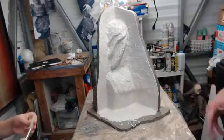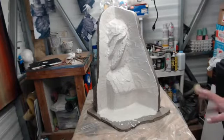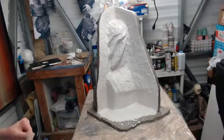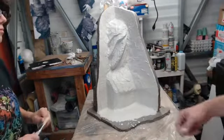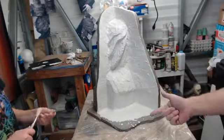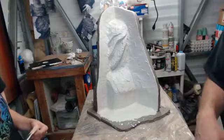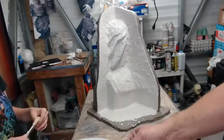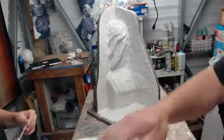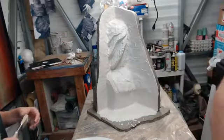Now, the good thing is once you get through the first couple of print coats, you're pretty good. You don't want to get too lazy. But if you find you have a little bit of air bubbles in there, now it's really going to start to ash quick. You have the heat generated from the first coat and the dryness, then you're putting another coat, so you have the mass and the heat generating from that. Every layer you do, it gets hotter faster and starts to ash faster. So sometimes if you have to forgo a step like the air bubbles, that's the time to do it, because you're already 2 coats in.